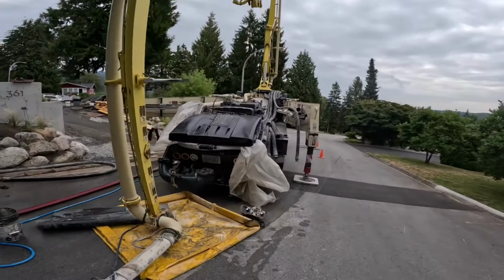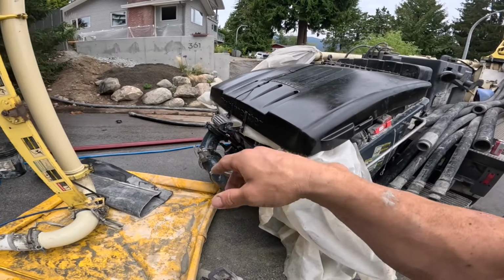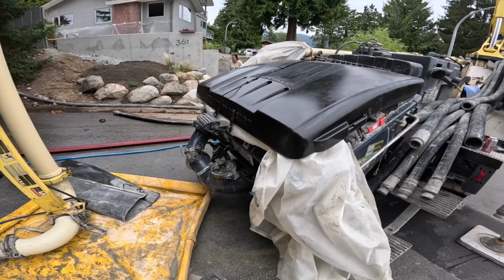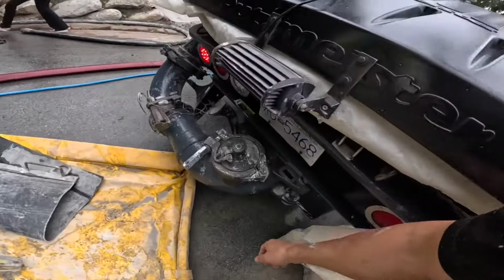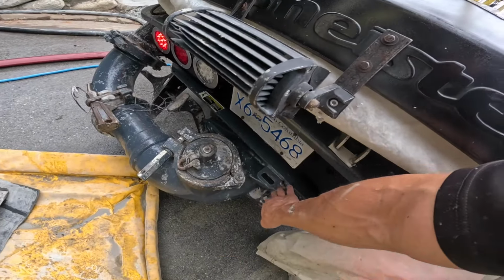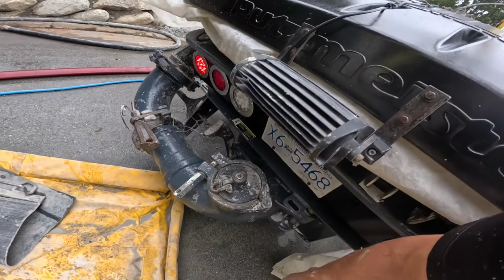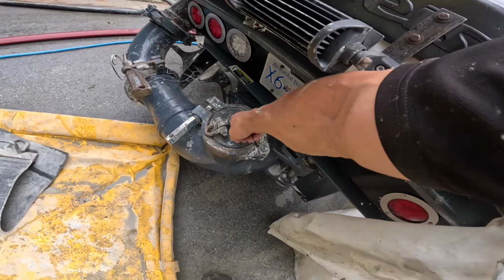I've seen guys that'll paint a mark on the second ball, so when they open the back end up, they know that they're looking at the second ball, not the first one. Well, we use a hard sponge and a soft sponge, so I can tell the difference by looking at them. And with the pin there, it stops them both right there anyhow. It keeps them from getting sucked into the back end. With the water in between the two, sometimes that water can flush the first one in and cut it. That's why the pin is super helpful. Pin stopper.